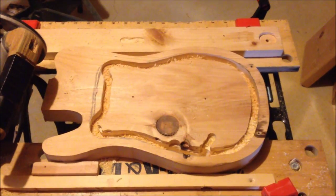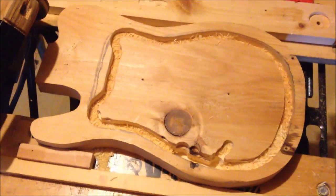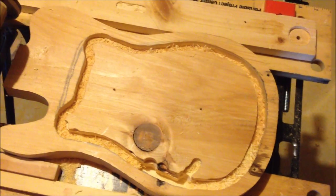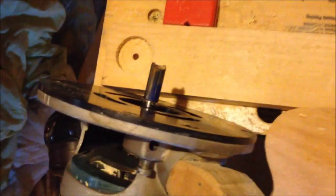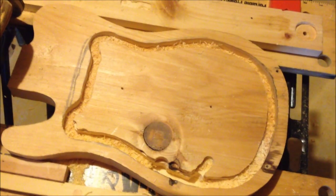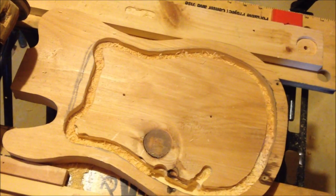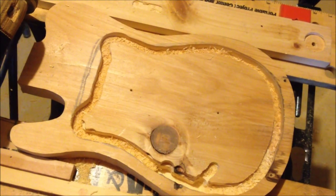The first pass is an absolute breeze. The second pass is the tricky one because you're routing through a space that is only as wide as your router bit, and there's nothing to stop you moving outside the path you're trying to route — that takes a little more finesse. The third pass, my bearing is exposed, so that's a snap because I can just follow the first path effectively. Anyway, one more pass to make that big block in the middle fall out. I'm thinking of screwing the two bodies together so I can kill two birds with one stone and get that pass to include the initial route on the other workpiece.